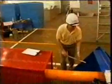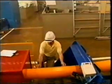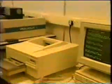Diametral and longitudinal measurements are taken at predetermined intervals, as well as winch loads, speeds of pull, and temperature measurements. Thousands of measurements have been analyzed to produce a predictive model to give various parameters for the swage lining operation, including die sizes, towing loads, pipe insertion diameters, and final offload dimensions.